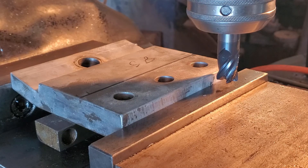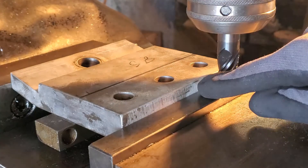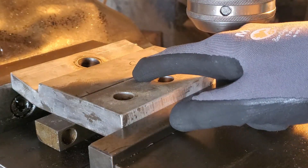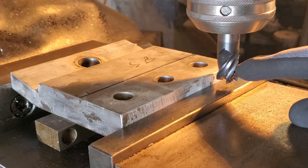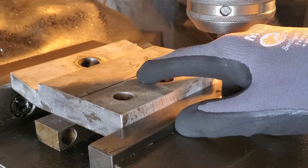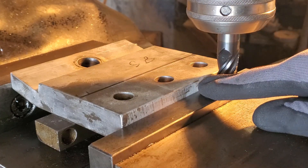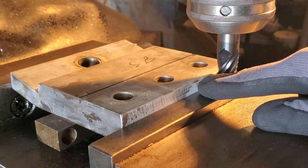I've set up to do a fairly hefty cut on this 304 stainless part. It's got to be a quarter inch deep and ultimately two inches across the face. I'm going to use the three quarter inch rougher-finisher and try to do full depth, full width passes until I get back to that line. First thing I have to do is touch off on the side and set a zero on the DRO, then set up my table feed starting at about three to four inches a minute and see how it goes.